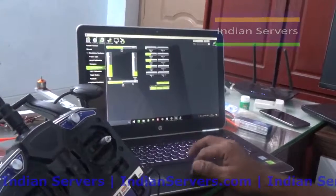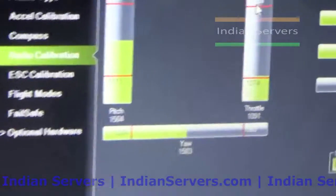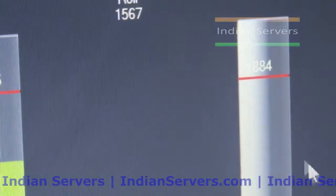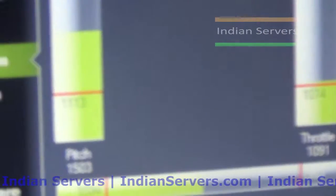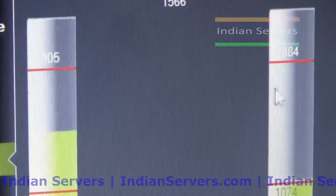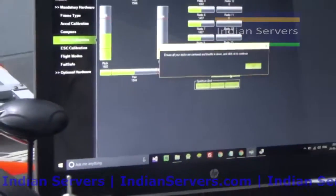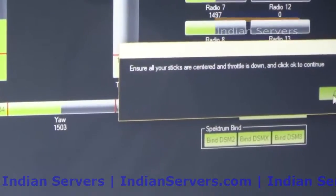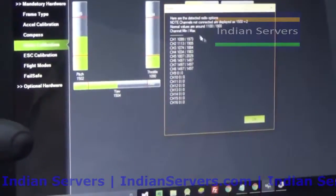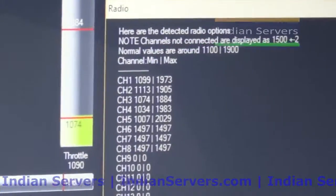We have given the minimum and maximum positions. You can see values from 1000 to 1884 for throttle - these values are PWM values. For throttle, the minimum value should be less than 1100 and maximum more than 1800. Move all the sticks randomly and click When Done. Lower the throttle to the lowest position and click OK. The new settings - minimum and maximum positions for the sticks - will be saved.